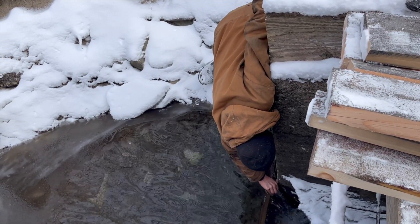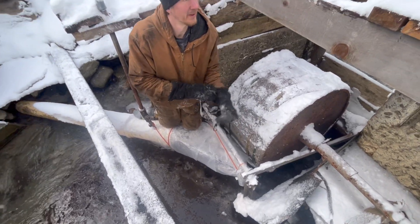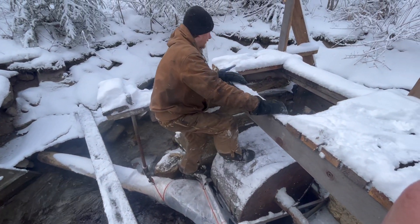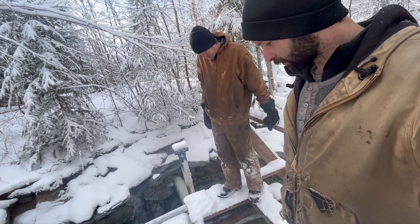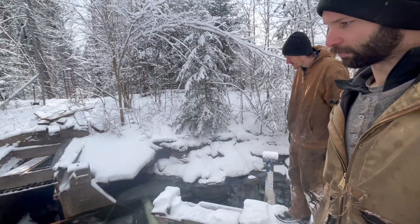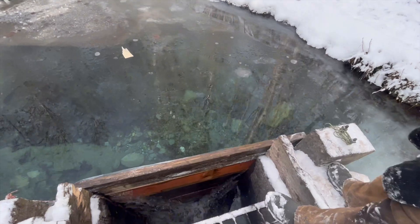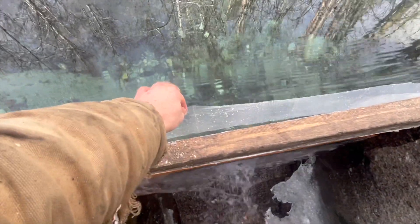The temperature is cold, Mike's hands are freezing. To deal with some of the gapping in our metal pipes as they've eroded, we have wrapped them in a layer of plastic — very ghetto, hopefully very effective. There's a little bit of water hammer effect — hopefully the pipe can handle it, but the water is bouncing up and down. I can see water going over our spillway so I'm going to put another board on there. We've used a piece of plastic on the outside of our boards to create a much tighter joint on the dam.